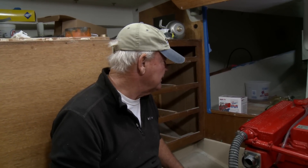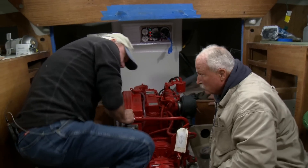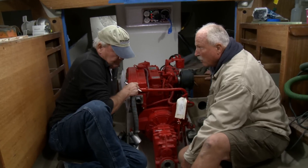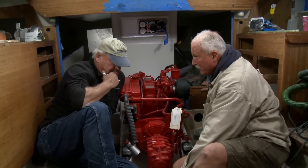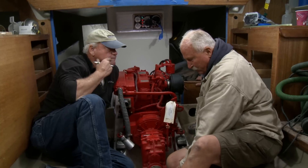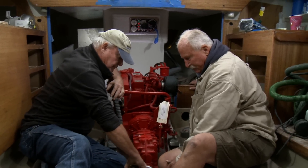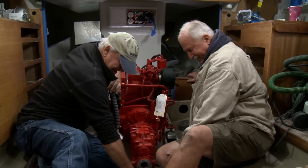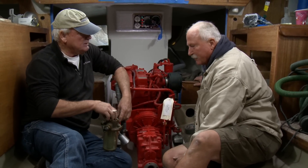A few other things: trying to locate the through-hull for the raw water pump which takes in the seawater. We've talked about a number of different locations under the cabinetry of the quarter berths, but the suggestion is to just put that through-hull down in the bilge — down on the wall of the bilge. It's accessible, you can see it. We can put the raw water filter down here also. There's enough room to accomplish all of those items. Otherwise it has to go on the bulkhead up here where you can get to it, but that real estate is going to get gobbled up pretty fast. As long as we can get the top cap off the strainer, we can get to it.